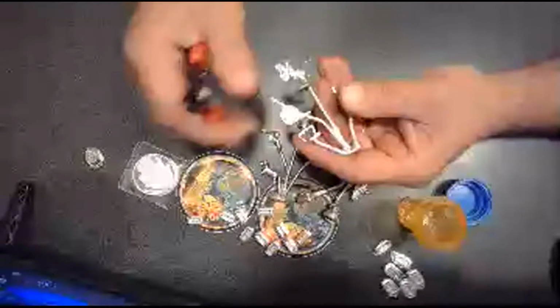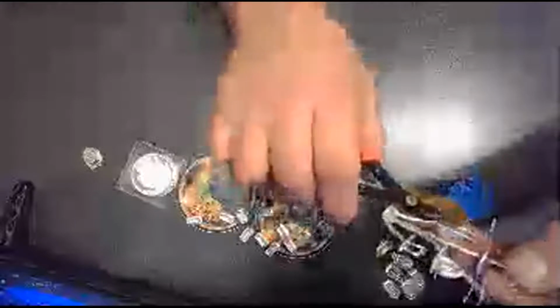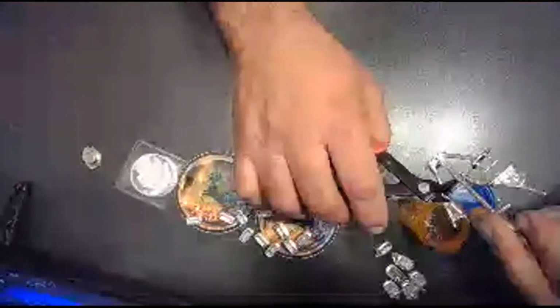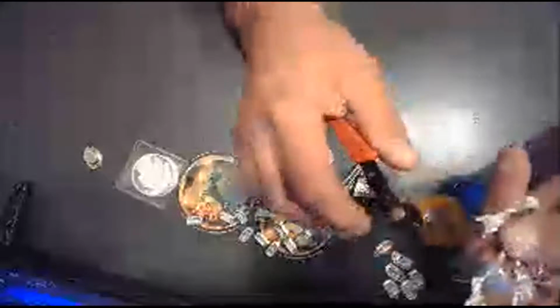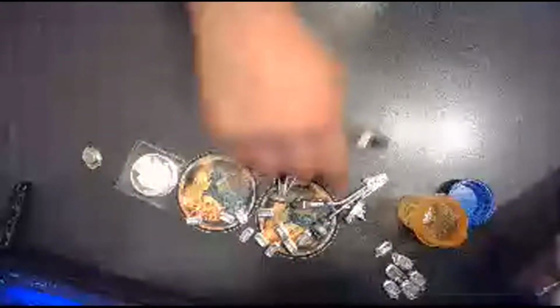little old bitty pieces. That's when you usually know you got a pretty good pour too, when these little vent holes show up. I don't know if everybody does this. I haven't seen everybody else doing this, but when I make my pours, I always try to put vent holes in there because liquid going into a closed area creates pressure. And if you're getting pressure, well, I didn't know I put them back here on the handles. Apparently I did. If you're getting pressure, then it causes problems. I just dropped that little piece. There it is.